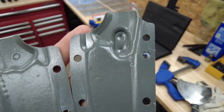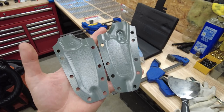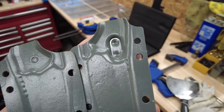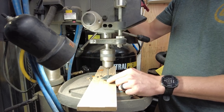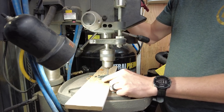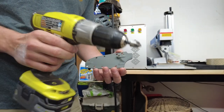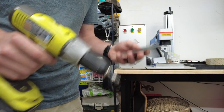For the final finishing, I don't drill the screw holes on the mill because I do batches of these where they're all custom ordered — left hand, right hand, ambidextrous — and I would have to call up a new program for every single one. So I left a little nipple on the 3D print so that when I take it over to the drill press and knock those out, it self-centers. I've started chamfering those holes just to make them look cleaner — a 45-degree chamfer-style bit, generic hardware store stuff, spinning really slowly — just throw a little chamfer, try to make them even.